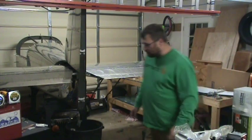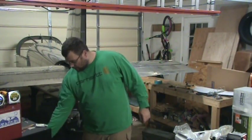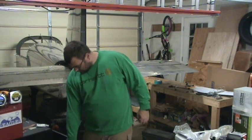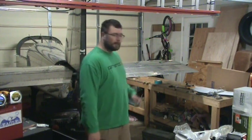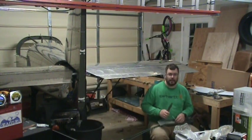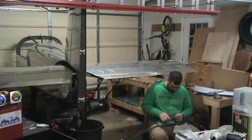All right, I have my trusty 9-volt here. I just need to strip off a little bit of insulation and give this a shot. Hopefully no magic smoke comes out. The big thing on this is make sure you don't connect any power source to the blue, green, or orange wire. That's a big no-no.